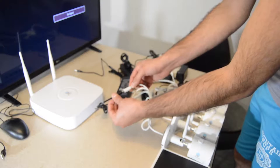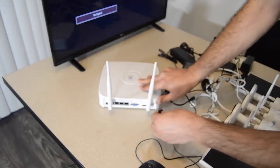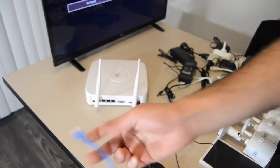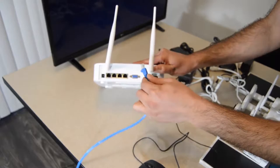I plug the cameras on. After plugging in the cameras, I set the mouse to the USB port and plug in the cable. Then I connect the network cable here — one side goes to the WAN port on the NVR and the other side goes to the back of your router.